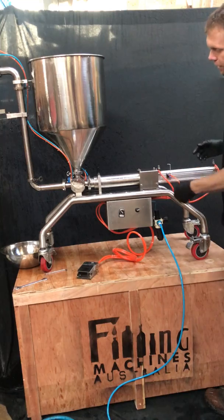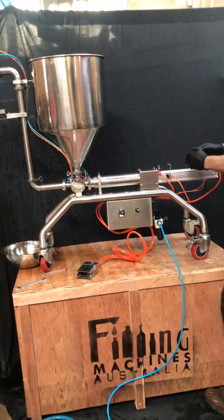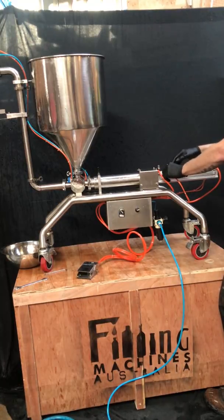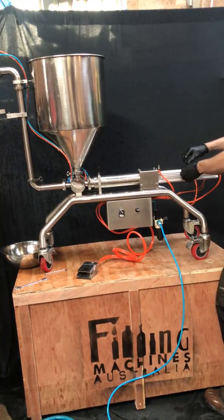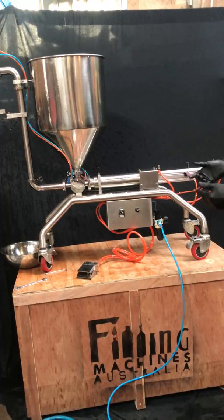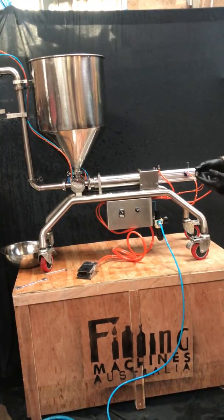With today's demonstration, we went through a few of the things that can go wrong — basically over-tightening of screws and slide switches being set slightly too far. The measuring tape at the top is just a guide. Once you find your desired fill — say about halfway on a single cylinder machine — that's going to be about 500 mils or 500 grams. Nip that off there if that's the size you're filling, and then measure or weigh it using a measuring device. Once you're happy with the output, you can leave it there and use that as a reference point, double-checking with a measuring device each time.